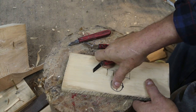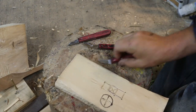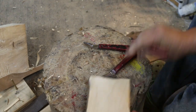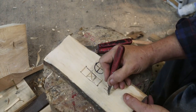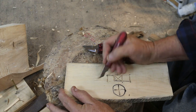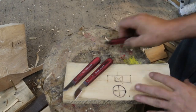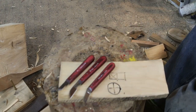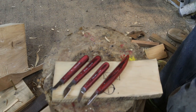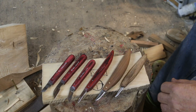You can see those slivers coming out of there. You can do that with a bench carving knife but you need to stand it up more — this one's a little more specialized with that 45-degree angle right on the end. These are the three primary chip carving knives; if you were to look at chip carving lessons on the web, those three shapes are what you'll see, plus each instructor may have their own unique shape they prefer. Three chip carving knives at the top, bench knife at the bottom — I recommend you start with that. And here's a spoon gouge.